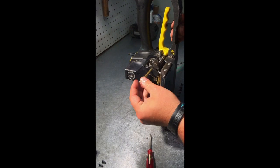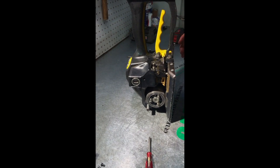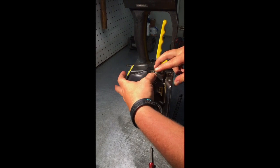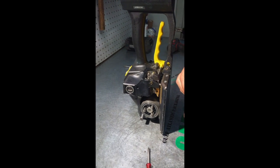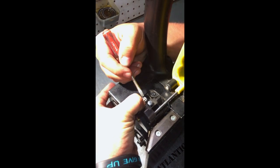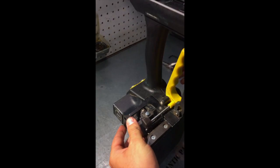You want to take your gold pin and reinsert it into the side. Going back to your thrust piece, as you see on the front of your cutter block there are two grooves cut out for it. So you're just going to pull back on your seesaw levers a little bit and place that in there — everything should fit smoothly. Now you want to go ahead and reinstall your snap ring. Place your snap ring over the pin and snap it on there.